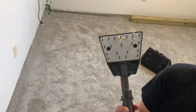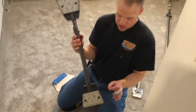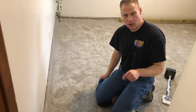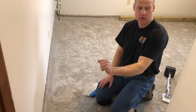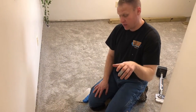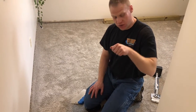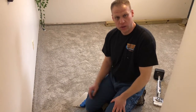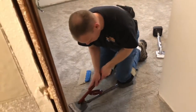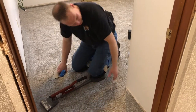It has the same teeth as your knee kicker and your carpet stretcher going through your material. It is important to have some weight on the kneeless — it will rake really bad on that backing if you don't have it slammed down in there. The guy from Canada who made this product, you can see him pushing it down in his video. I found out at my shop that if you don't, it's just going to rip the backing up.